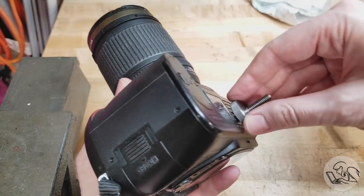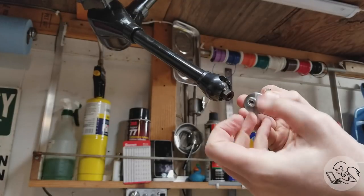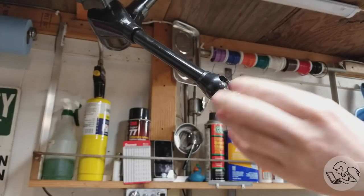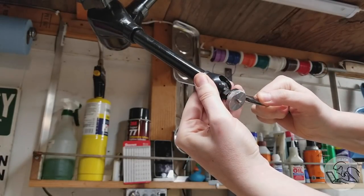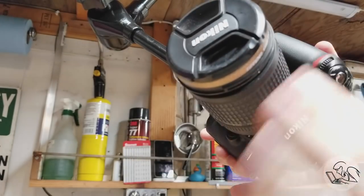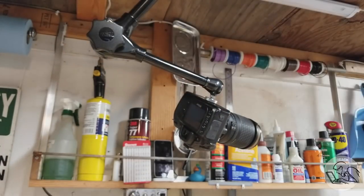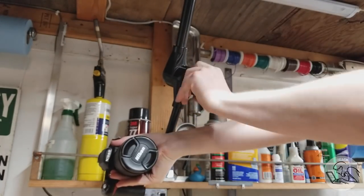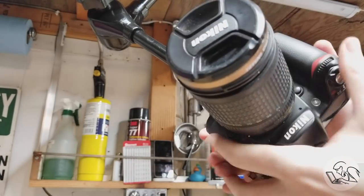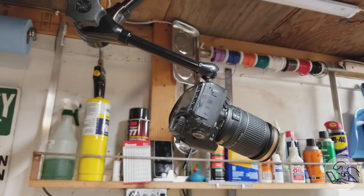Let's talk about that flush seating problem again. Here's what happens if we just thread it on as is: you can see that the base of the thumb screw doesn't quite sit flush on the base of the camera, and that's important because that flush surface is what's holding the camera in place — that's what locks it in. In this case, the thread isn't bottoming out inside the camera; it's that little bit of shoulder where we couldn't get the threads all the way down that's causing the issue. But we can just put a jam nut on here now, which keeps it from coming loose from the Noga arm. So if you don't have a thin enough blade to undercut the thread, another way to do it is just to put a little star washer on there, and that takes up the space of that shoulder where there's no thread, and also helps lock the camera in place so that its own weight doesn't cause it to unthread. Now if you're worried about the star washer marking up the bottom of the camera, you can also use a rubber pad like what a lot of tripods use, but in my shop the cameras are tools — they're not museum pieces, and they've got to earn their keep. One weakness in this design is that because there's no free-spinning element in the system, it's a little bit fiddly to get the camera on and off — you actually have to kind of wind the camera body itself around. So we're going to look at a more sophisticated version of this device in the next video that will address those concerns.